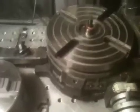Put it up in your collet. You want to make sure all of your bolts securing the table are loose. And you just put it up in the collet, tighten it up, bring your table down. As it comes down into the taper itself, you'll see the table move in whatever direction it needs to go to locate center. And then once done, you just keep your spindle down so it's tight to the table.